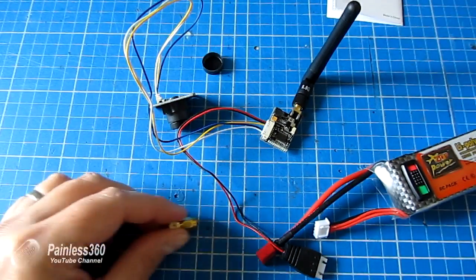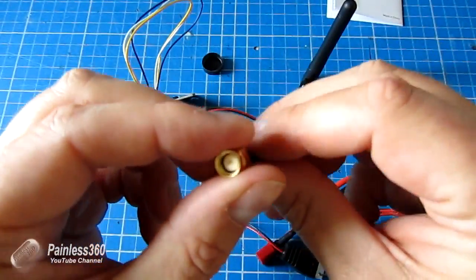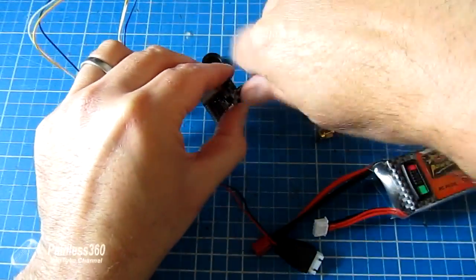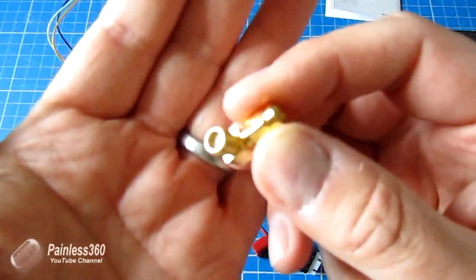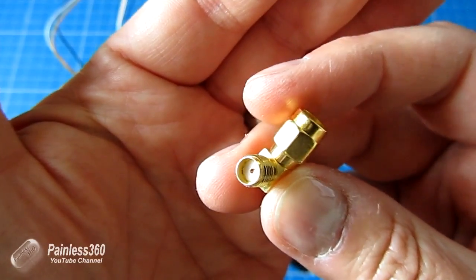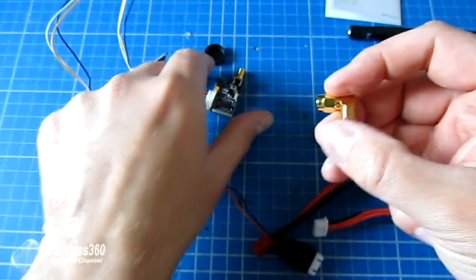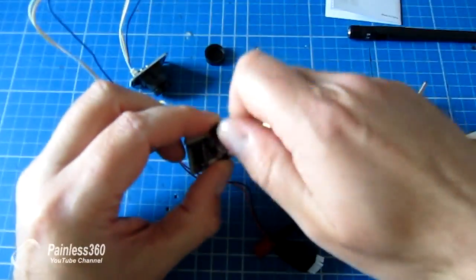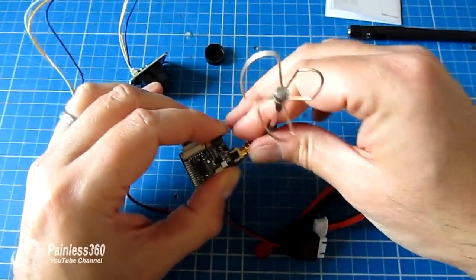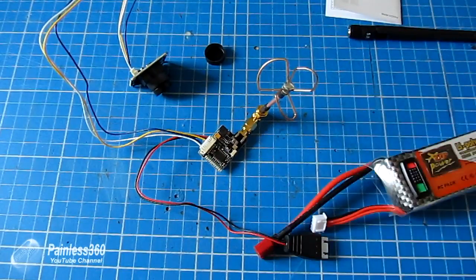You can buy cheap and cheerful circular polarized antennas. All the antennas I buy are the kind that fits with Fat Shark, with the pin in the middle. To get these to fit onto this transmitter, you can buy a little right angle SMA adapter — which I use on a lot of other models anyway, because it lets me point the aerial straight up. This adapter has no pin on either end, so I can pop it onto the transmitter and then plug my Fat Shark aerial onto the top. I'll put links in the description for both a suitable circular polarized aerial and this right angle adapter.